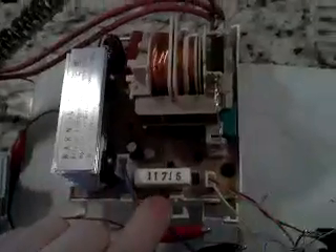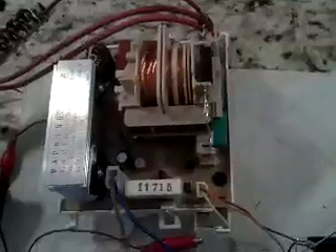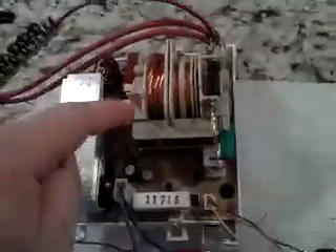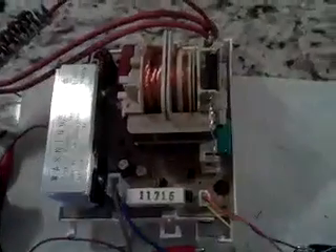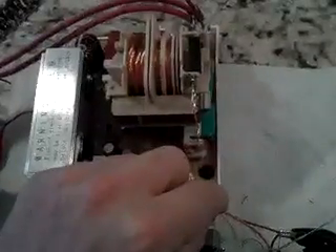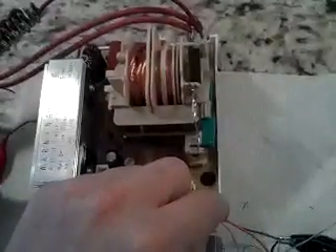Here's the essential part. This is the AC input connector. Blue is hot, gray is neutral. It can be connected to AC line power without any output from the inverter until you apply the right logic signals to these three control lines. It only draws about 50 to 100 milliamps in standby.